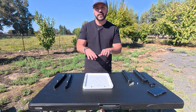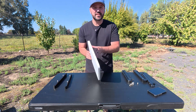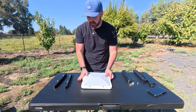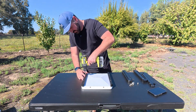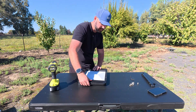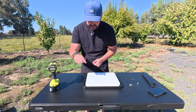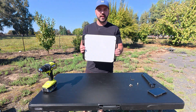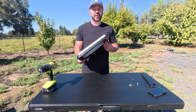Once you have those threaded inserts out, you can go ahead and place the mini inside the hard top face. Slide the mini in there, and since this is CNC precision cut, you'll notice that the mini just fits perfectly — it doesn't shake at all inside our hard top. I'll go ahead and put the sides on first, and then we can slide on the rack adapter, flip it around, and use the same exact bolts, now moving them in through the top.